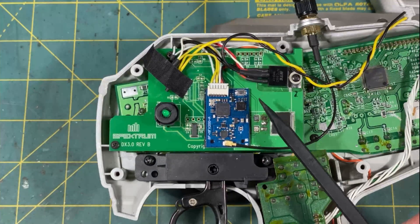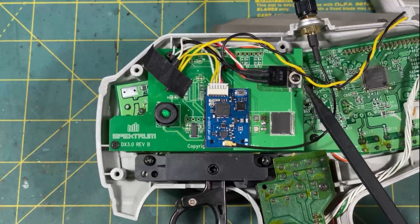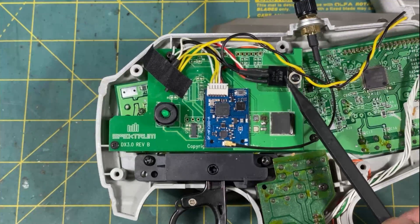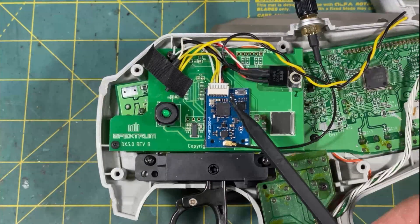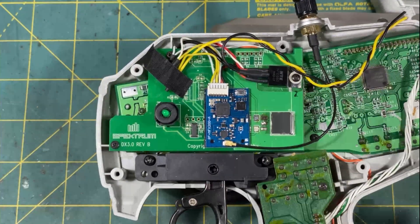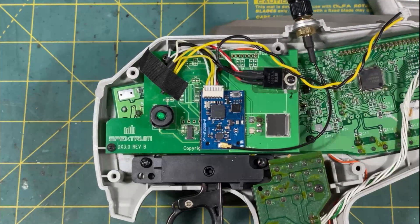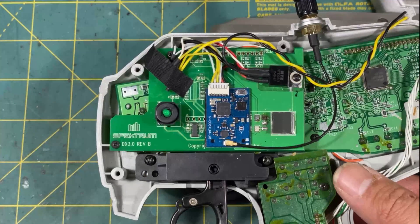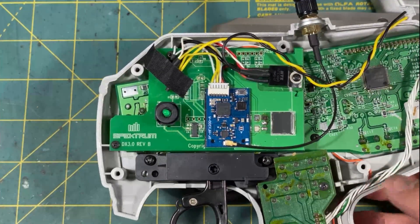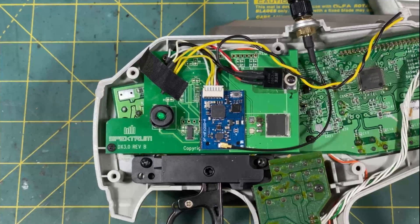Over here I have an NTE 960 — it's a 5V power supply. The instructions for the DSK 124 say it can run on 3.7V to 9.6V, but in testing on my first one, it did not seem that tolerant of overvoltage, and I think that's why my first one blew out. So to play it safe, I'm running this 5V power supply to give it a constant voltage source. Then I have the antenna going out, and I did have to use a longer antenna — I was having glitching problems with ASF with the standard antenna that came with this board.